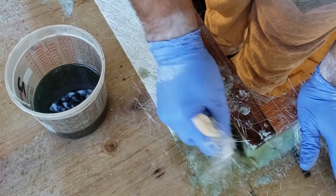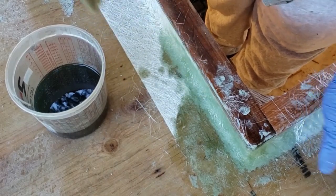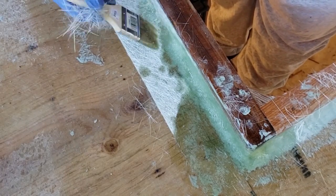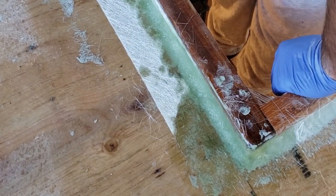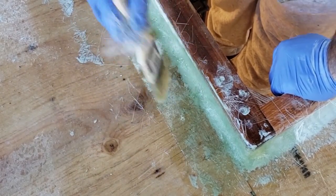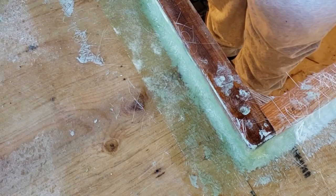And we'll do this all the way around. And then I only do up to the top of the skylight, because on the top curb, I'll do the same thing. I'll wrap from the top down, so that I'm not trying to do two wraps at once. It's the same process if you're following along as we did on the drip flash on the trailer. That's on both sides. It's a lot easier to work with smaller pieces and smaller runs than trying to do it all at once.